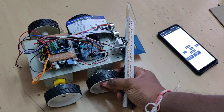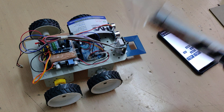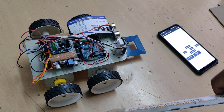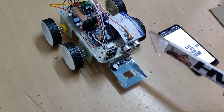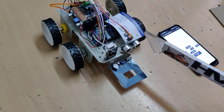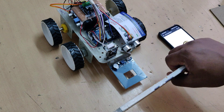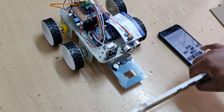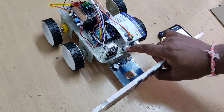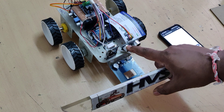While the robot is moving in forward motion, if any obstacle is present, we automatically switch off the power supply to the motors, stopping the robot. We can still control the robot movement in the remaining three directions if an obstacle is detected. The ultrasonic sensor module has two components: a transmitter and a receiver. The transmitter emits ultrasonic sound waves, and if any obstacle is present in front, the obstacle surface reflects those transmitted waves back to the receiver module, triggering the controller.